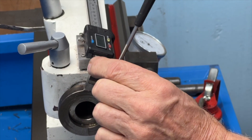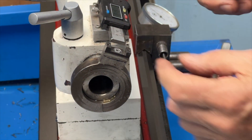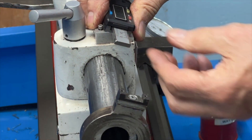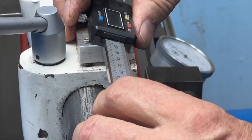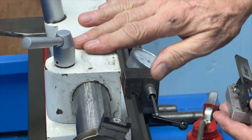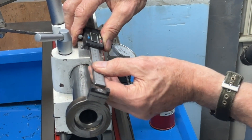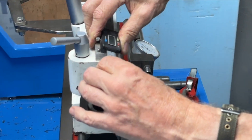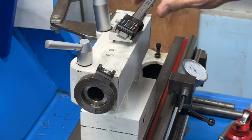If this isn't straight coming out of there it doesn't work. I made this with a notch in it, but if I did it again I would put the notch facing down and make it a flat piece, because that makes it easier to adjust. The main thing is when this is extended out it still has to fit level. Some tailstocks have a rounded top so you might have to do a little work to make a holder, but remember this has to go straight out or it'll jam.